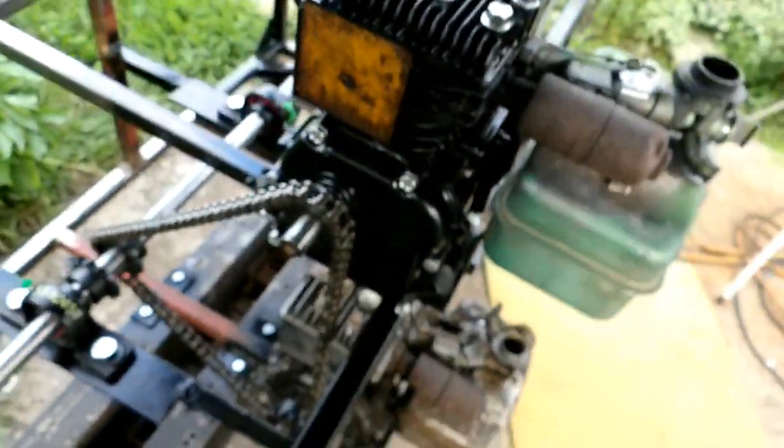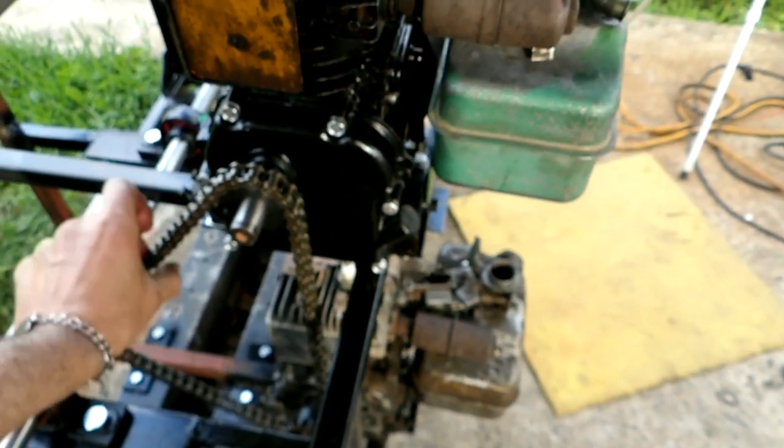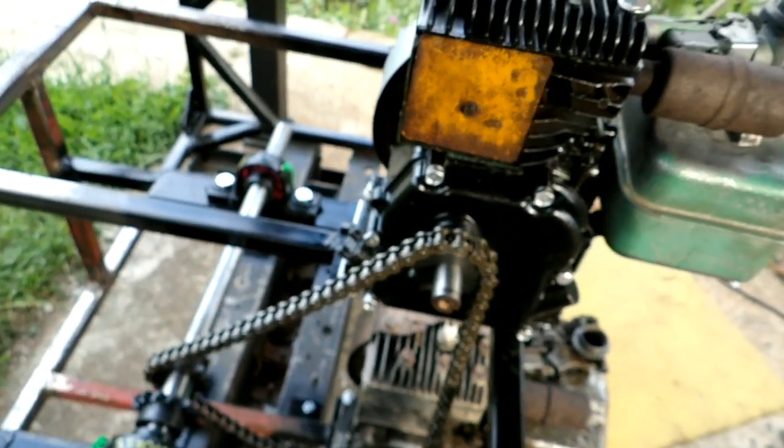I successfully shut the machine down there. That was pretty exciting - I didn't like walking past it. It wasn't that loose when I started; I guess you get initial chain stretch. My calculations worked out good but I still needed a little bit of tension on it, so I put a shim under one side of the top motor. That was my plan all along - to shim the top motor.